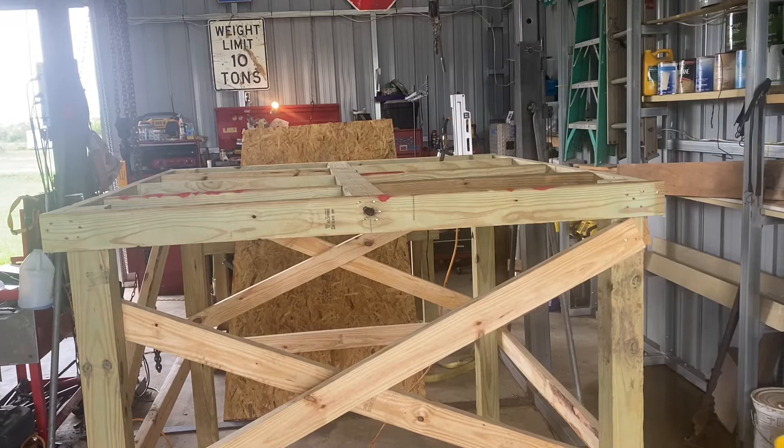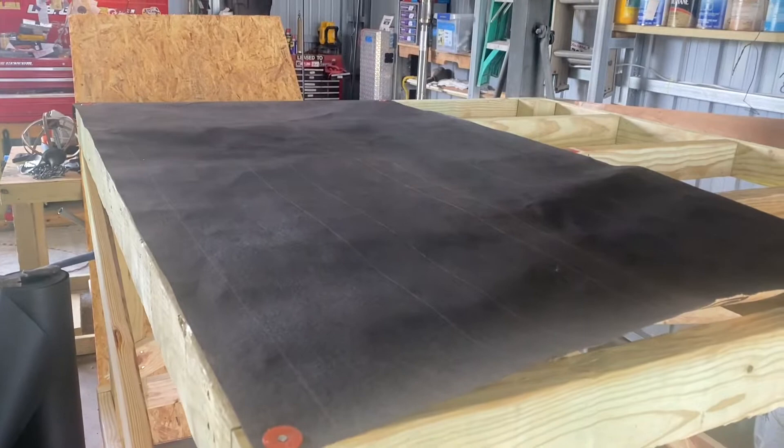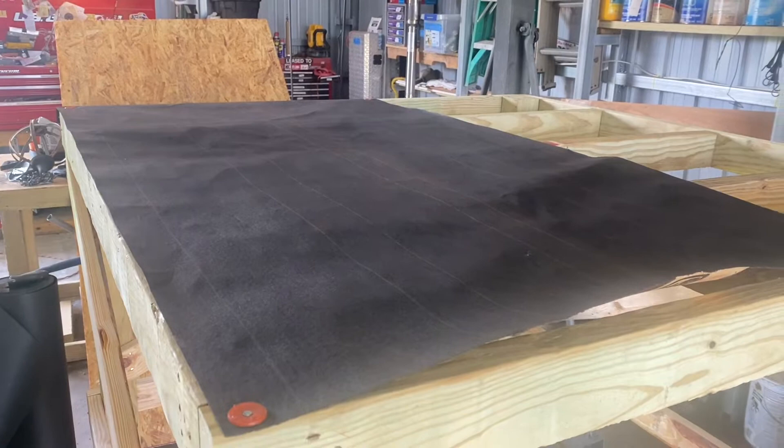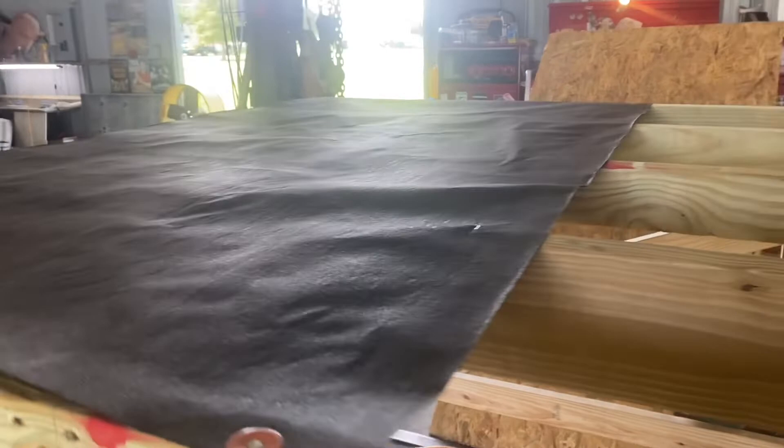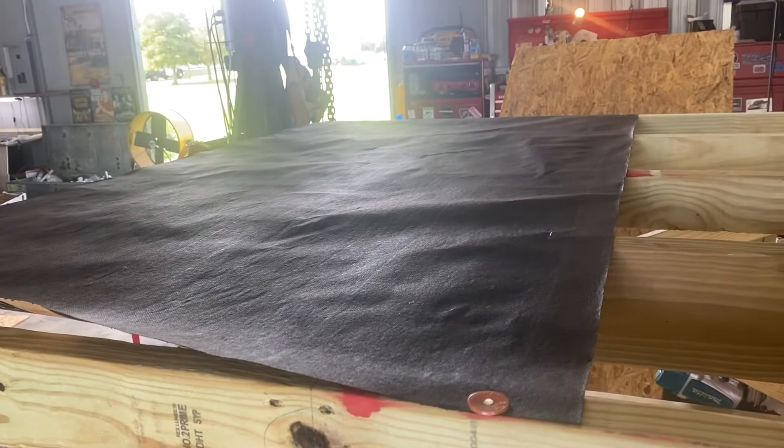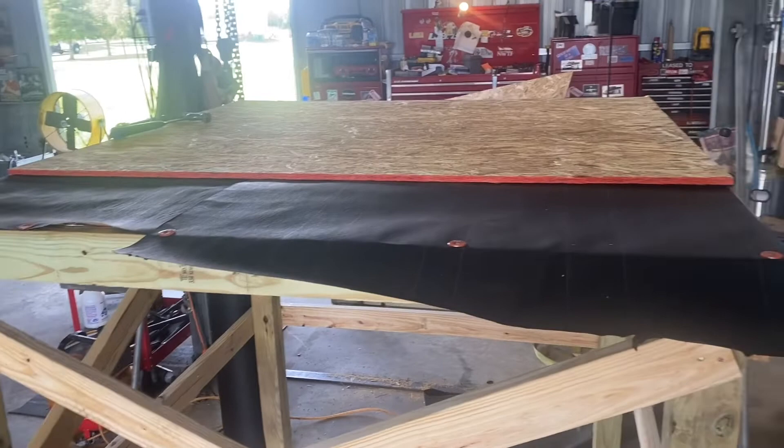That's the first piece of roof felt paper — tar paper, we call it. I'm running them opposite of the way my OSB flooring is going. I only put four staples in the corners because the floor is gonna hold it down, keep the bugs out, keep everything waterproof.